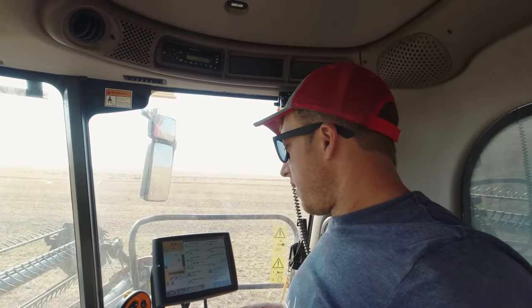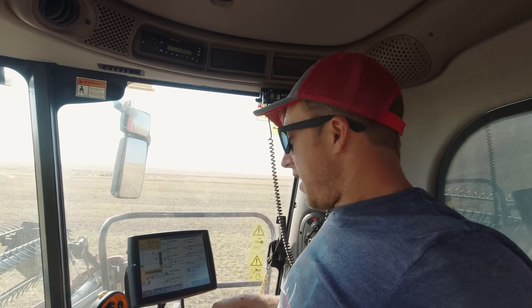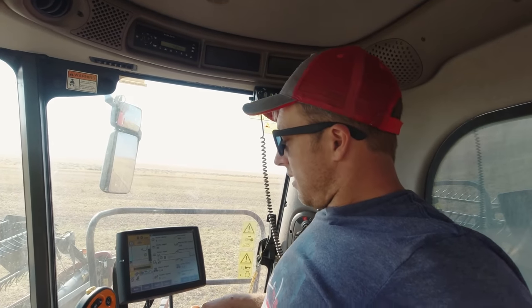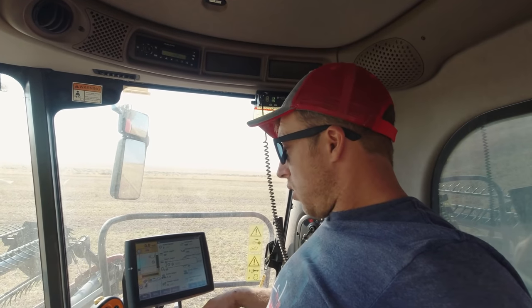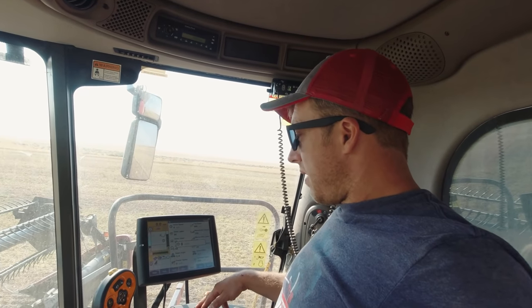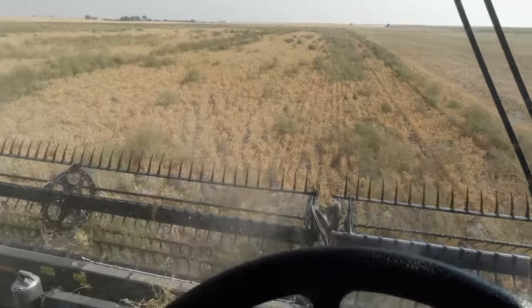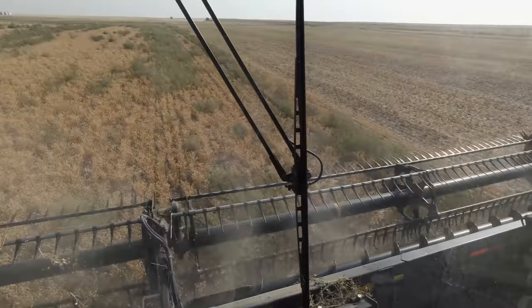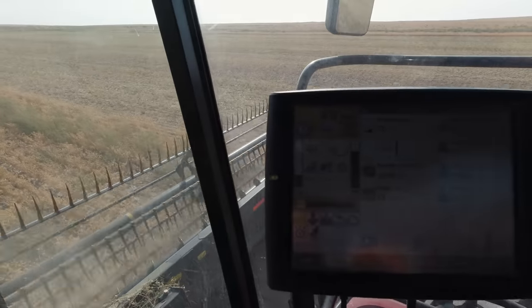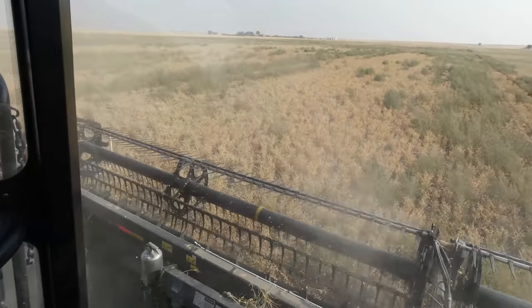I slugged it pretty good, so I'm running the de-slug right now. I just got it freed up once, then I engaged the header and a big log went in again — jammed up again. I'm rocking the rotor back and forth with my fingers, 50 RPM at a time left and right, gaining work speed every time. Eventually it'll kick it all out. The de-slug — if you're operating a combine that runs a belt to drive the rotor, I'm sorry. This CVT transmission running the rotor de-slug — didn't get out of the cab. In about two minutes I had it going again, and that was plugged pretty bad.